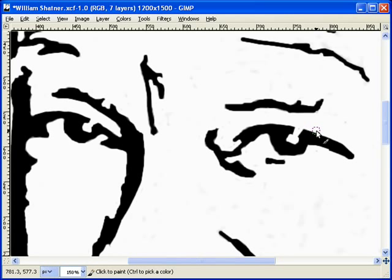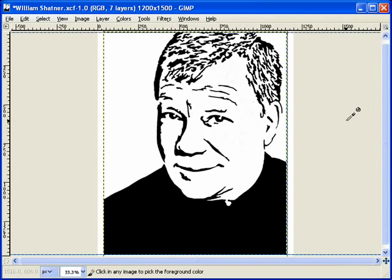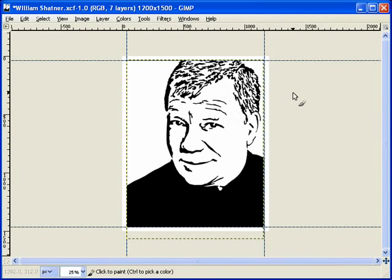I do this a couple of times — I'll print it out two or three times before I'm satisfied with the way it turns out. One thing we try to avoid are islands. We talked about how islands become a problem because once you cut around an entire piece of wood, it's just going to fall out onto your shop floor. One of the unique things about scroll saw patterns is that all the pieces support everything else, so we try to avoid islands as much as possible.